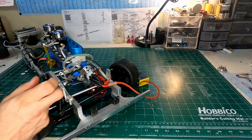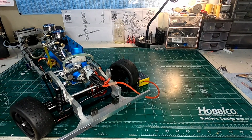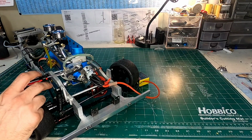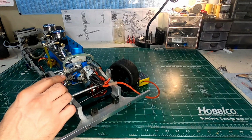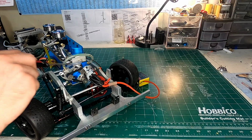I've also turned the impeller around, so now the motor doesn't have to work at all to put the impeller through the water, because it's not even really doing anything, but it still could be slowing down the motor. So why not just flip it around? The other thing too, I need that impeller in there. I can't just pull the impeller out, because then the seal will leak, and all I'll have is coolant coming out the front of this pulley. So we don't want that either. So I left the impeller in.